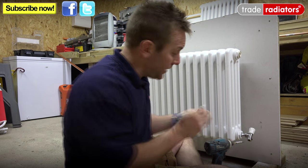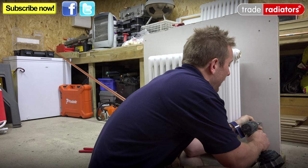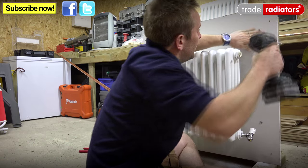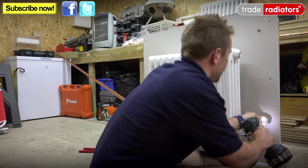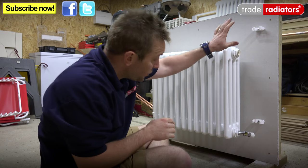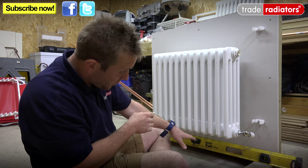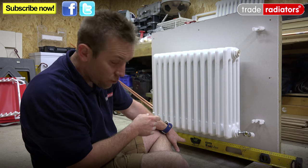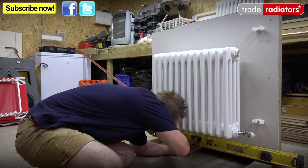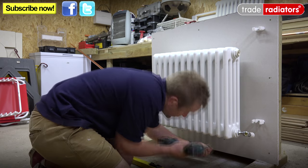So now I've drilled my pilot holes, I'm going to use these fittings here which are brilliant — you've seen those in our other video about how to hang a column radiator and see how good these are. I'm just going to put them in now. There's the other one. All I need to do is just screw my clips on. So we've now got our two clips down the wall like so. We know that we're going to run our other pipe around the bottom here and all we're going to need for that is a couple of clips. So I'll put my spirit level under there, make sure my bubble's in the middle, and then I'm going to put a clip just about here and a clip just about here. I'll get a couple of pilot holes and then same procedure — just get these popped in.